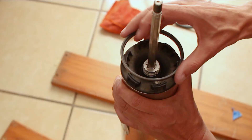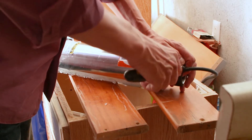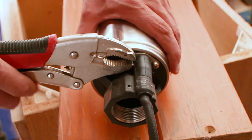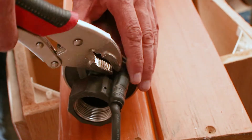Off camera I removed the rubber o-ring seal. Also within the housing you should find a plastic ring that sits between the motor base and the rubber seal ring. Remove the upper cable clamp. Below this clamp the cable is secured to the pump housing with a plate and two anti-tamper screws. I removed these screws using locking adjustable pliers, which was very time consuming.